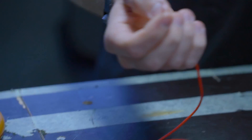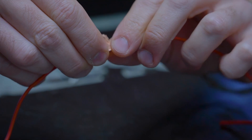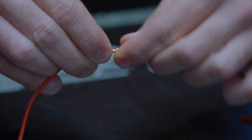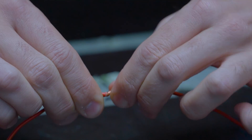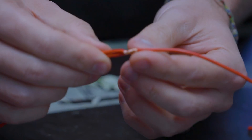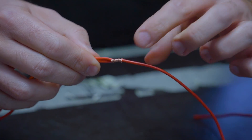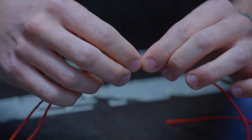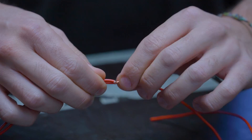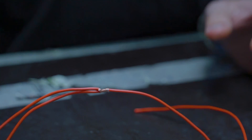Once we've got that, we're going to place this wire under here and just twist it around the copper nice and tight — so it looks like that. You don't want it pointing out or sharp, because when the solder goes on it's going to pierce through the heat shrink we place over at the end. We want it nice and smooth, not pointing out — it shouldn't poke you at all.